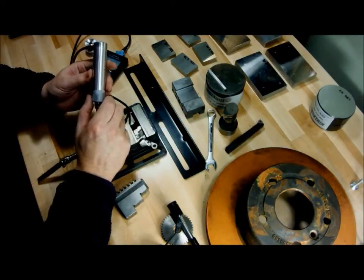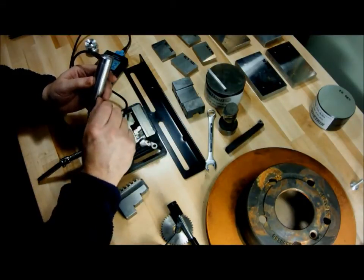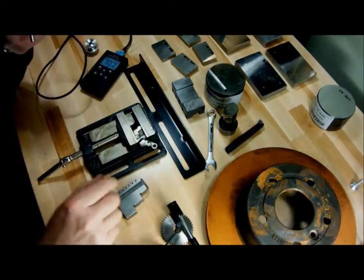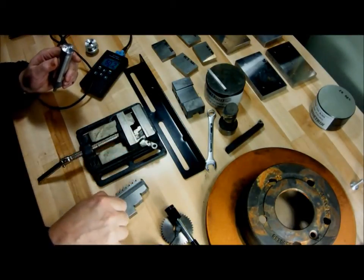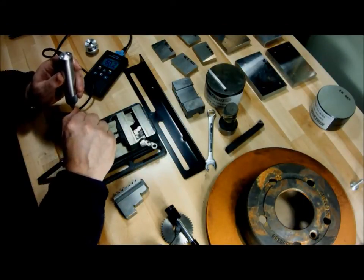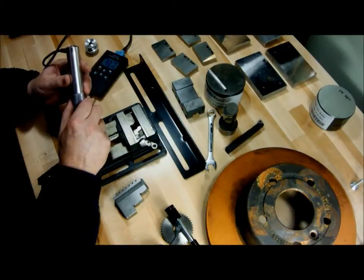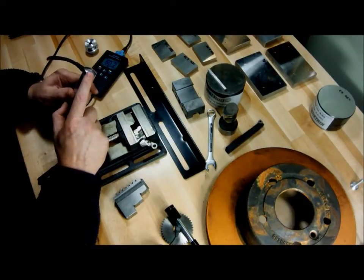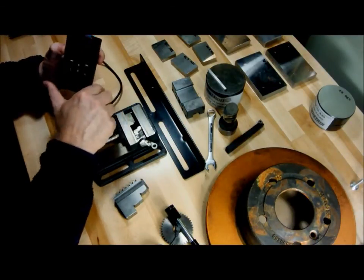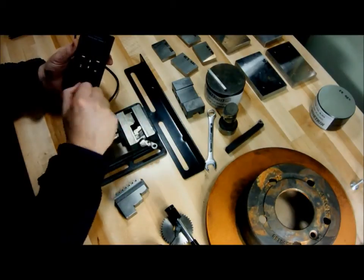More expensive, but it has a fairly good range of capabilities. If you were to be measuring larger, heavier parts or both ferrous and non-ferrous materials, and for price point, the rebound tester is great. For smaller parts — even down to parts that are very small that could never be tested with a rebound type because they're just too small and the vibration would be absorbed by the impact — this is great. This is around $1,700, which is a third the cost of its next closest competitor. And a great feature of this one is that if you do want to go for rebound, this same device can plug in a rebound tester — it's the only one on the market anywhere in the world that can take both a rebound type tester and this ultrasonic, so you really have the best of both worlds.